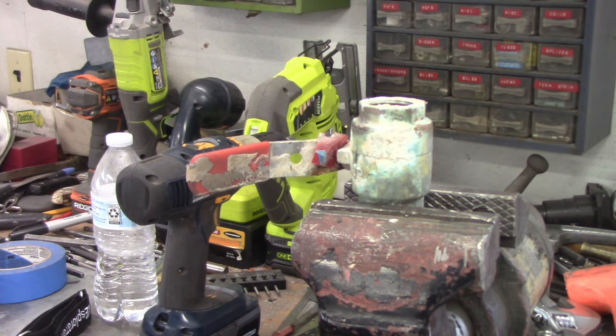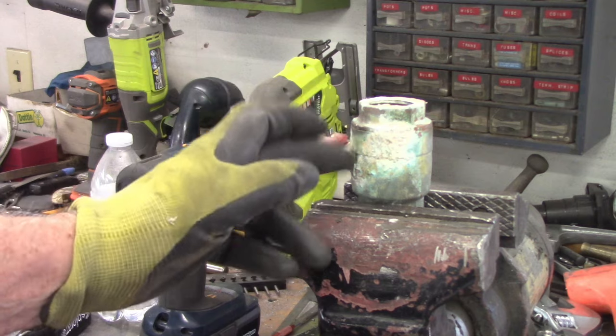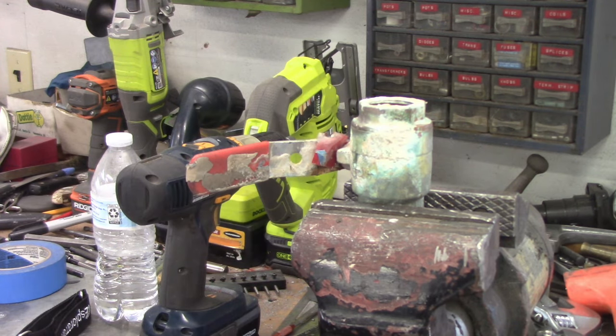Good morning, YouTube. This is Chuck Gentles. I want to thank you for coming by this morning. I've got about a half a dozen projects going on here, so I'm going to start with the first one first, which is this ball valve that came from a condensate drain. It's an inch and a quarter, which is a little odd for plumbing stuff. This thing split last winter right there and was leaking like a sieve, so I'm going to take it apart, get the ball out of it — it's solid brass, yellow brass, but still solid brass. That'll be one of the projects we'll start this morning.